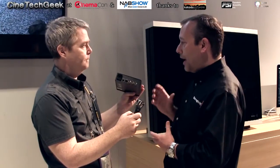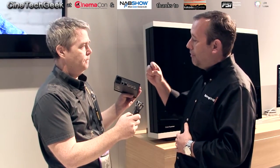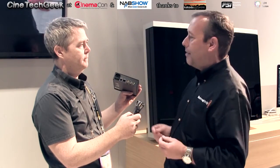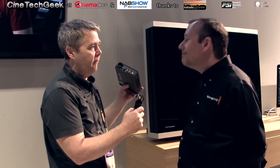This is a standalone product to do that job, but one of the things we've talked about this week — in the press conference and on the booth — is we see the integration of IP into all Blackmagic Design products moving forward. Imagine a smart view monitor with just an IP connection, where you could connect to it via fibre, SDI, or IP. We actually have a prototype of that on the floor here, so you can see it's already coming. You could also see the switching range — your 12x12 or 36x36 — having a new module that adds IP ports as well.